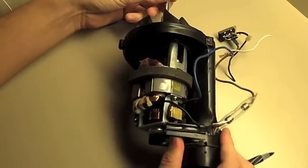There are two copper windings fixed on opposite sides of the armature. The two copper windings together serve as one permanent magnet, with one coil being the north pole and the other coil being the south pole. The armature spins so that the positive side faces the copper coil with the south pole, and the negative side faces the copper coil with the north pole. The last component is the two fixed brushes that surround the commutator. When the commutator spins, it rubs against the two brushes. The contact between the commutator and the brushes causes the armature to switch its poles so that it has to reorient itself. The armature's switch in polarity happens every half turn, and this causes the continuous rotation.